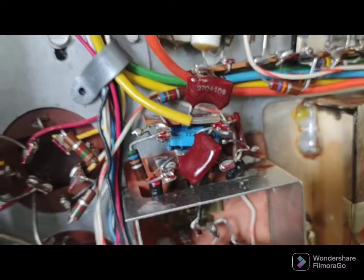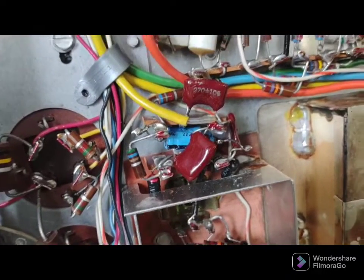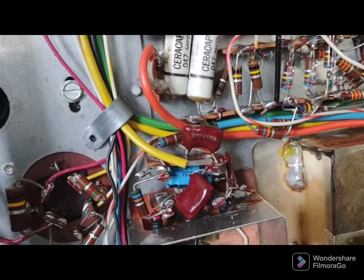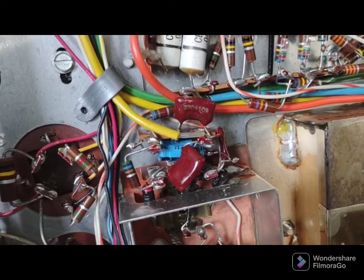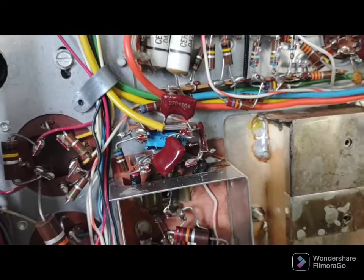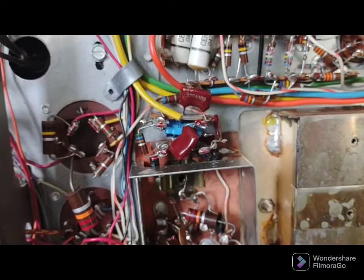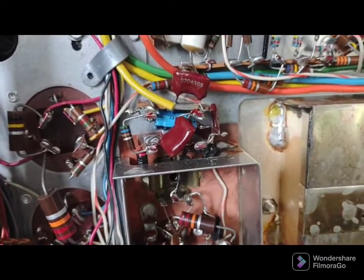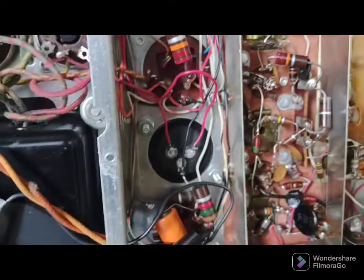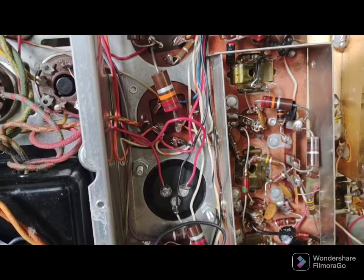It's been a while since I took FM in college, so this might just be a bypass capacitor. What you want to do is change one part and then try it, because any time you deviate on a value it could be critical or it could be non-critical — so just be careful with that. She's all set now. Just going to make sure my DC balance is correct between the output tubes and put this back together until I can work on it again and change the next high-voltage capacitor — the 4 by 20 microfarad at 450 volts.